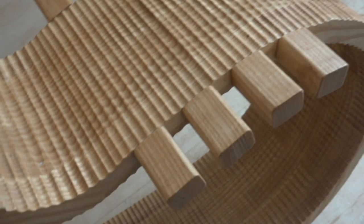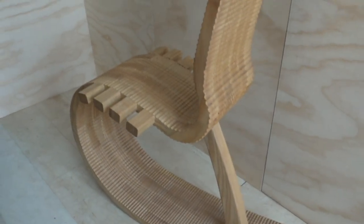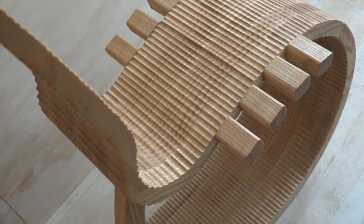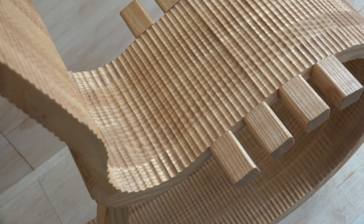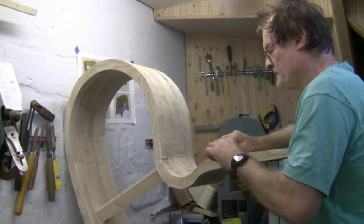The chair was made for a London exhibition in 2010 and I simply ran out of time, so for strength I added the upright. It's a compromise, really, to the original pure cantilever idea. The little seat extensions are jointed using a Festool Domino system and the ash inserts of course match the timber in the main construction.